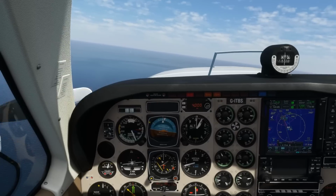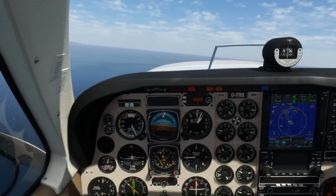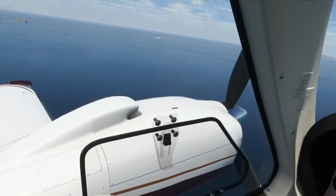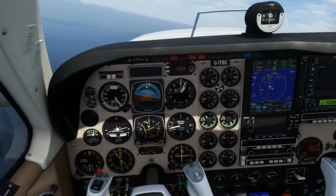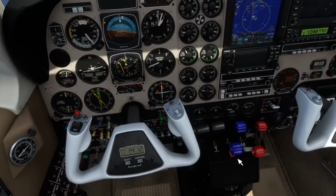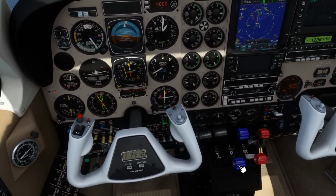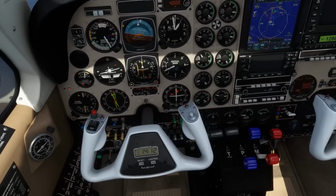And now we've got that prop feathered up as well, we can start reducing that rudder input a little. Definitely quite a lot of swing there with the failed engine. Lots of rudder required to centre up the ball, which is really nice to see. Pretty decent single engine handling overall from the aircraft. Prop lever unfortunately responding to my throttle inputs there by the looks of things. That's probably going to be an issue periodically throughout the flight.